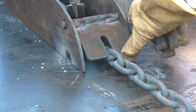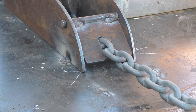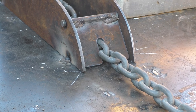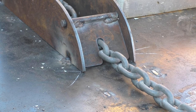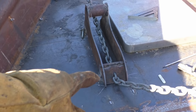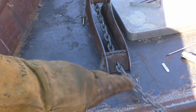Go ahead and back off the winch. Once it catches it, it's fine. But we need another roller here and let's make this pin higher up. I like this thing - it's nice. We need a piece of plastic out here on the deck. That little piece is called a chain stopper and that's really part of the design that I love, because that's what's going to hold the anchor. We're going to extend this out so that the locker's here and we'll put a pulley behind it to control the height of the chain.